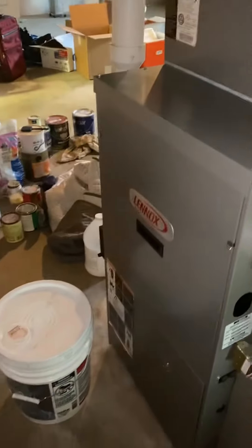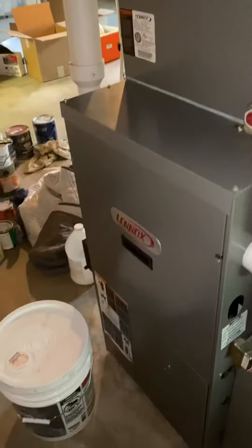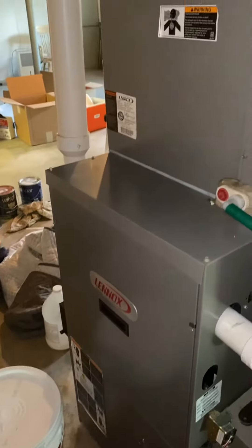Same width, 40 inches tall — same width on the coil. Come back in with a 34-inch tall furnace, six-inch base. Do same width on everything and it'll all match up nicely.